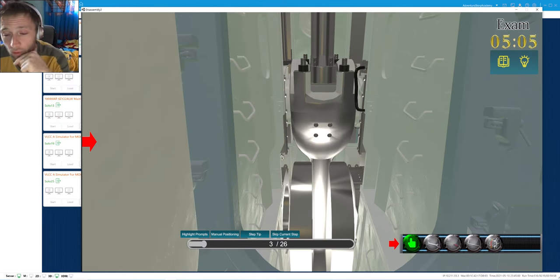These cannot be removed by hand because we need hydraulics. In your vessel there will probably be two hydraulic tools for two sets - one pair. What you will do is set one hydraulic at the back and one crosswise, release two nuts, then release the other two.